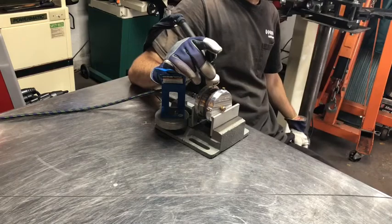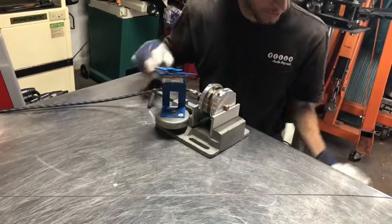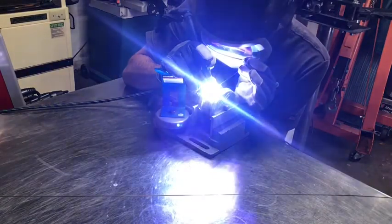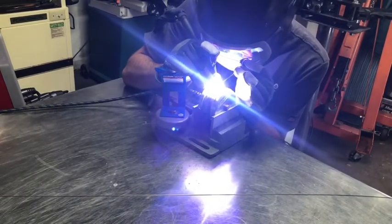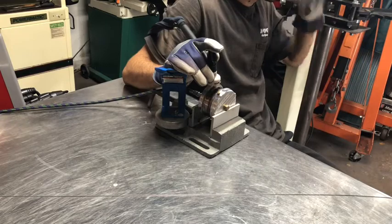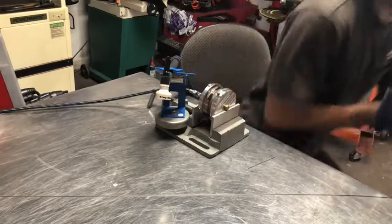Post flow is set to around 7 or 8. This joint is gonna get a little hot, so around halfway through I'm gonna stop and let it cool for a bit — it's such a small piece of metal. I'll continue this and put you guys on a time-lapse. This is gonna take four or five minutes, so I'll bring you back when I'm done.